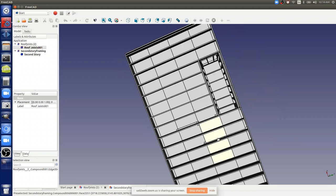What we do know is that the pattern is very regular, but there's a big complication with that door there, the entryway. Another suggestion that's possible is, there are two ways to do it. We can pre-cut everything, or we can go up there, do the full ones, put a board right across that, and cut them off. That's another way to do it. To cut it off in there, you need a reciprocating saw, whereas you use a sliding miter saw when you do it in preparation.